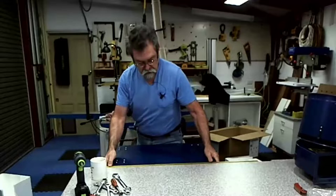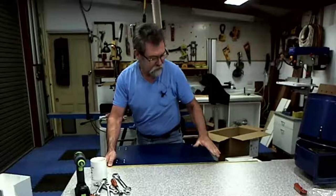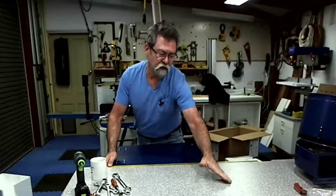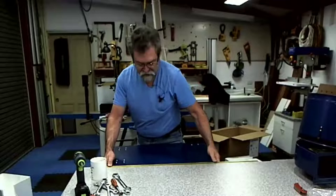It's beautiful and locked. Make sure the front is in line with the front, the back is in line with the back. And also one of the things you've got to watch out for is there's normally a chamfer on the edge of the wing facing to the front of the saw. So have a look at that first. The front of the saw normally has a chamfer, mine does. And make sure that the wing, if it has a chamfer on it, also is there, because it looks a bit strange if it's the wrong way around, pardon the French. Okay, and then you put your rails on. But that's a whole other story.